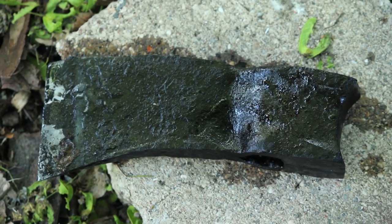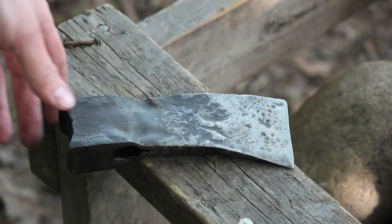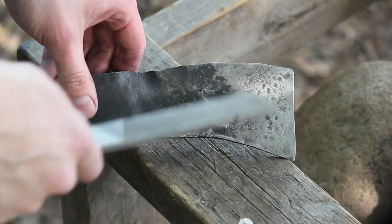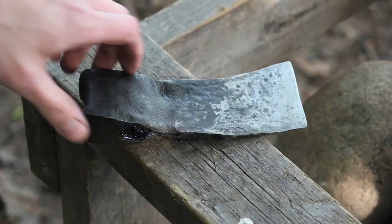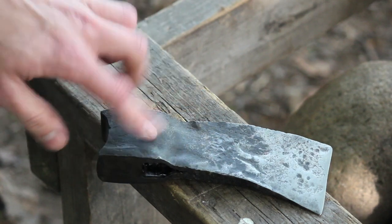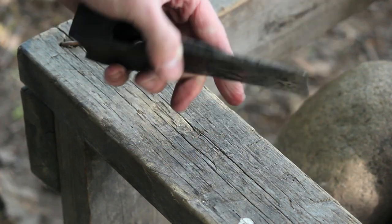Here's the axe after the quench. That might be one of those moments to look back on and say oops. Well, here's the finished axe head. I polished this part up on my sandstone. The corn oil I used for the quench actually baked this sort of finish on there, which is surprisingly very resistant to getting worn off, and it's actually pretty water resistant too.